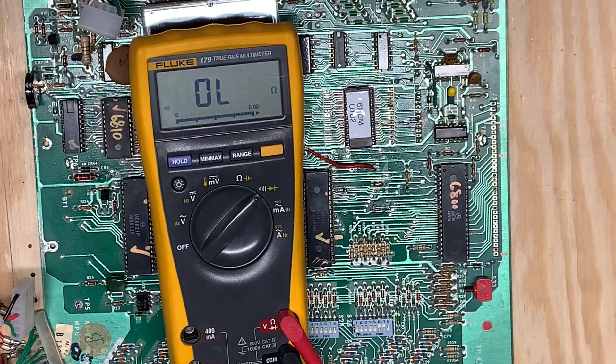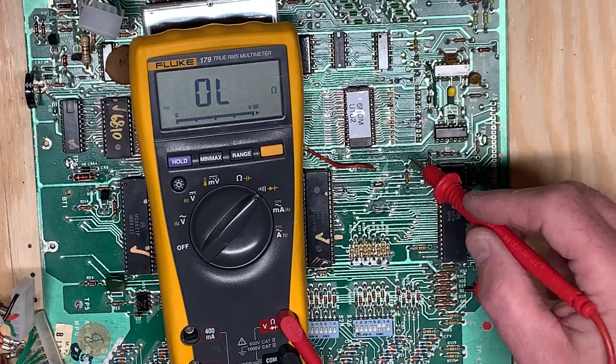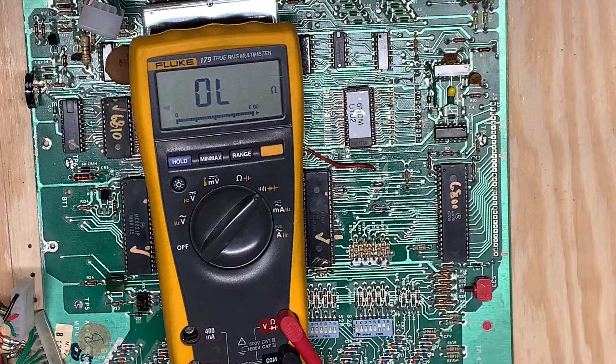This is a Bally-35 MPU board that I'd been working on, and I discovered a solder bridge between one of the address bus signals and one of the data bus signals — I think it was A0 and D7 — and they are adjacent to each other in the traces that run from U1 to U6, also including the 6810. I wanted to show everybody how you efficiently detect that you have a bridge between signals.